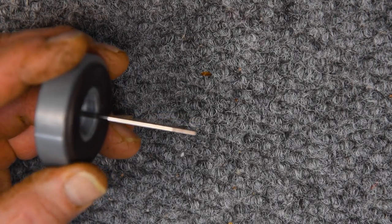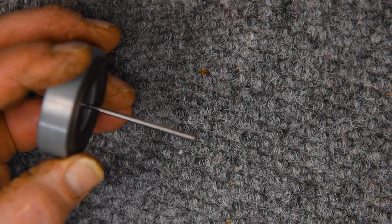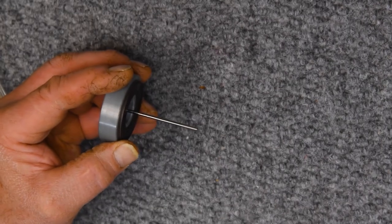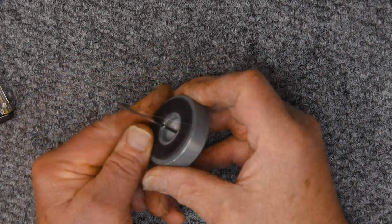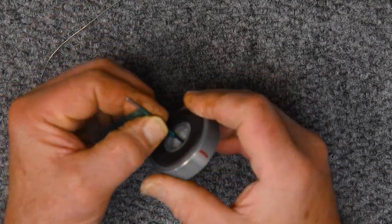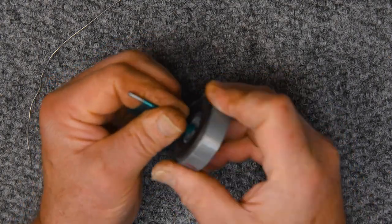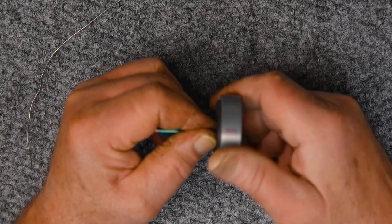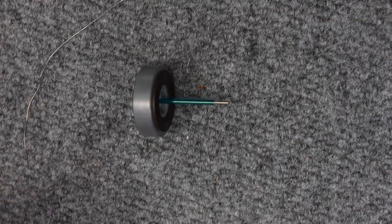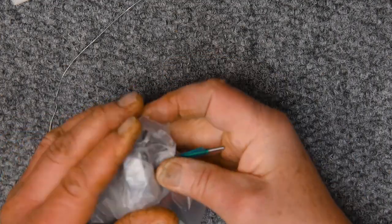I hear different things about using acids to etch the shaft. Probably not the best idea. Certain acids will cause hydrogen embrittlement in steel, and there is a simple procedure for baking that out, but the procedure needs to take place, and I don't know that you could really do it on this with plastic parts and so forth. Anyway, I wouldn't do that. I've also heard of people wrapping the pinch roller with abrasive and then just letting it run for a few minutes.